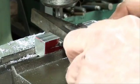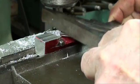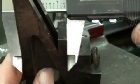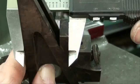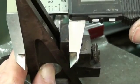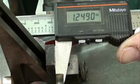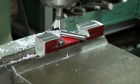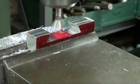I've taken several more cuts. I've got the dowel pins in there, and I'm using the planer gauge. Got it in there snug. Now we're at 253.5, fluctuating a little bit. I'm going to check it with the micrometer now, but I think I'm there. This, I believe, will be my final pass. I took off several more thousandths.